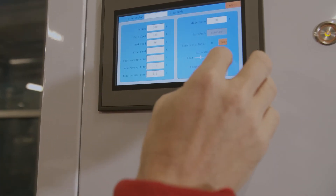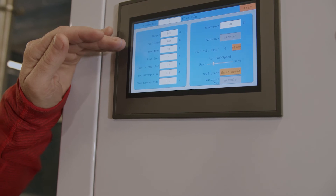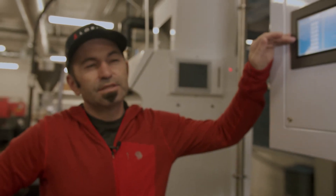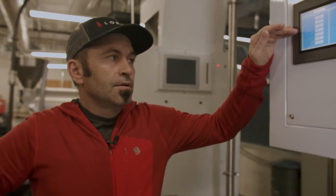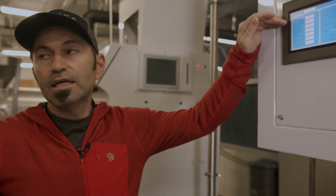These numbers can vary. Your medium feed could be anywhere from 70 to 110 grams — never really outside that range. Your fine feed could be anywhere from 6 to 20 grams, never really much more than 20. Your fast feed is going to be somewhere between 800 grams and 1 kilo. If you're doing under a kilo bag, you're not really using fast feed — fast feed is for bigger bags like a five pound bag, which is 2.268 kilos. So we're done with small bags. Now let's set up a recipe with big bags using fast feed.